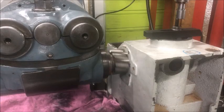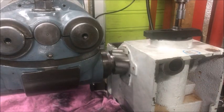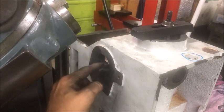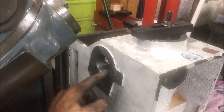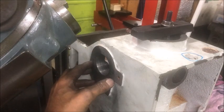Making a seat for the boss, then a boss on that other end cap. So the hole is opened up to 50 millimeters, plus a boss here to mount the adapter that will be bored a little bit off center, and also a place for a flange here if needed to secure it.